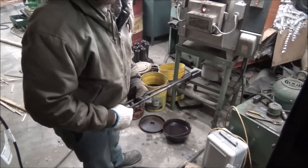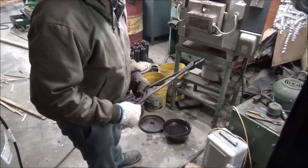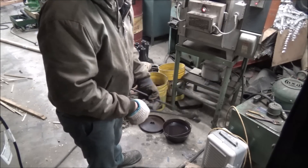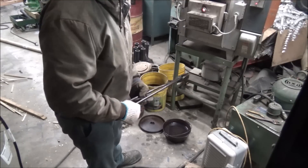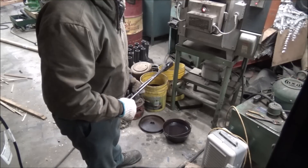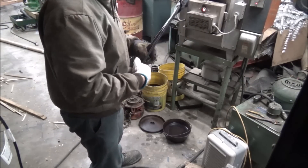The Easy Bake Oven has finished its job here, so I'm going to start fishing these out and throwing them in the oil and getting them quenched. I'm just going to throw them in — hopefully that will maybe reduce the amount of fire. If they go in quick, maybe it won't light off on top. This is quench oil, so it's not supposed to be super flammable, but this is hotter than a lot of tool steels heat treat at, so maybe that's part of the reason why. Eventually I'd like to have a big pail with a flip top, but I don't have room for that in here right now, so we'll do that in the new barn.